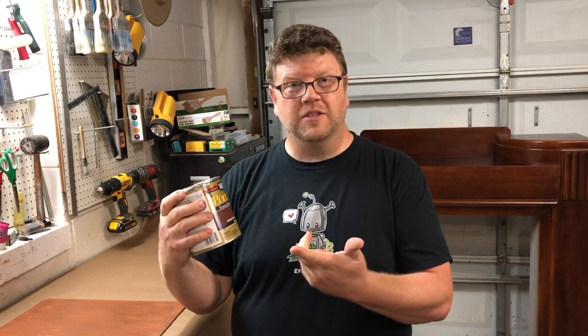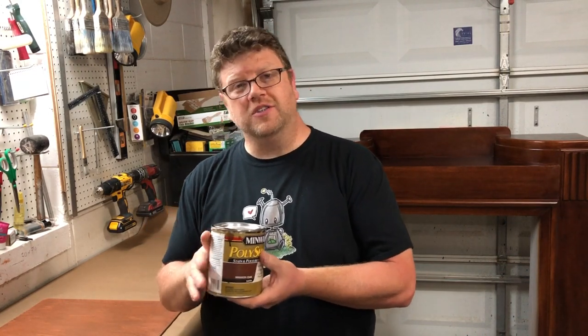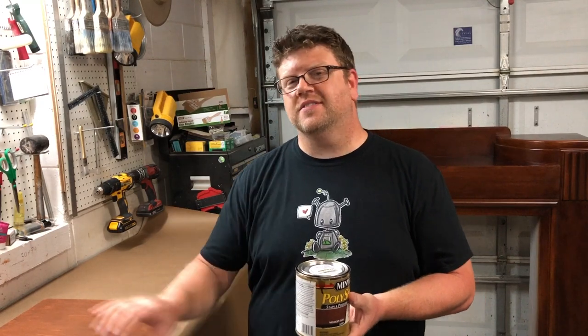And so this is what determines the tone. In my case, I want to use a mission oak, which is sort of a true brown. You could use something that was more like a mahogany to make it really red, or a true oak to make it really light and pretty. I'm going to use this. We're going to put it on just like the glaze. We're just going to try and soften it a bit more. So let's do that now.